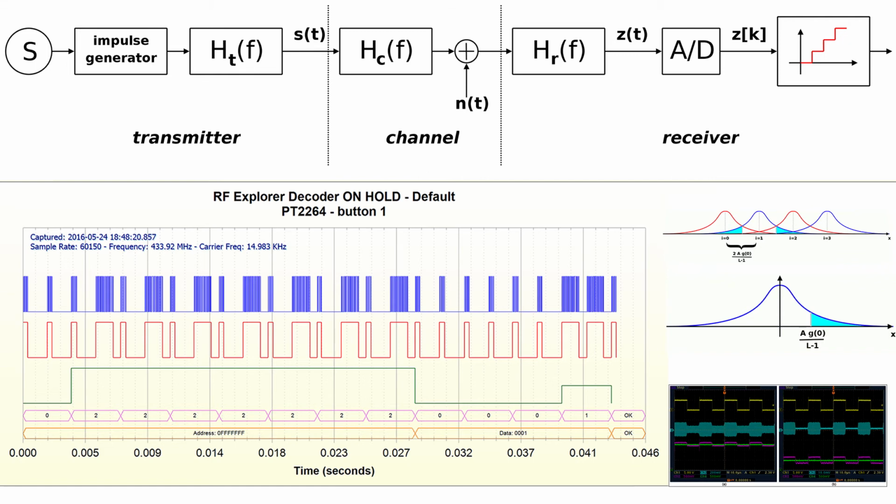There are a couple of things I would like to gloss over. I don't see any point of breaking down on how RF code is actually working. In a nutshell, most of them are using ASK method, which stands for amplitude shift keying. Simply put, normally nothing is being transmitted from this remote, so that's a null value. When sending actual data, this method distinguishes 1 and 0 using pulse length and interval, where 1 is a short on followed by a long off, where 0 is a long on followed by a short off.